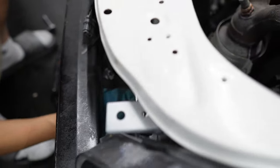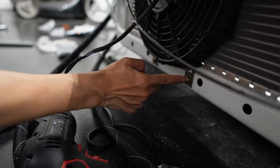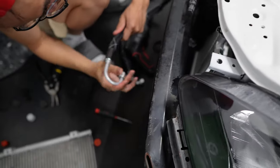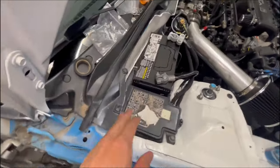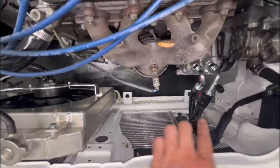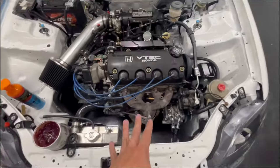Finally got this condenser on. The one that looks like an L will go on the top. Use the tappers included with the kit to mount this on, so it's definitely not going anywhere — you can see I'm wiggling it. Take our big one right here to there. And this last one is going to go right under here like this. And now, as you can see, I fit my battery in here and the fuse box just fine. You can see in the back that it barely clears the lines. And this time, you can just see two wires at most at the AC condenser. But you can definitely still fit a turbo in here.